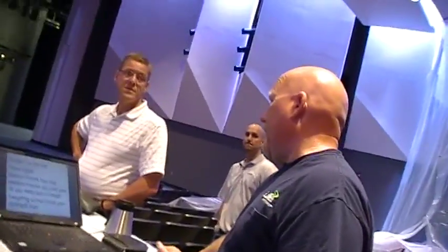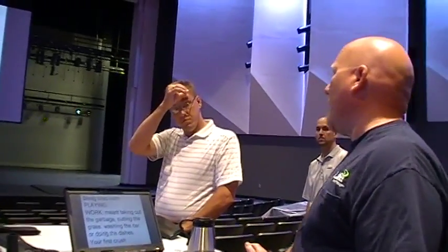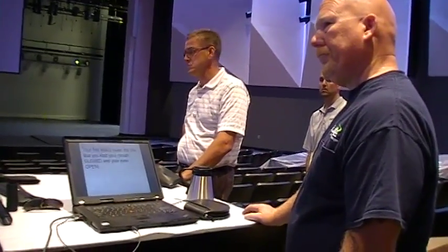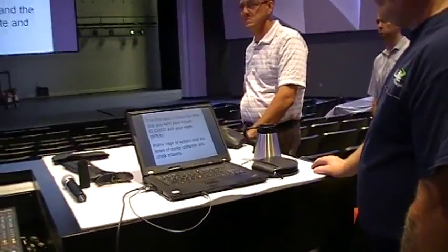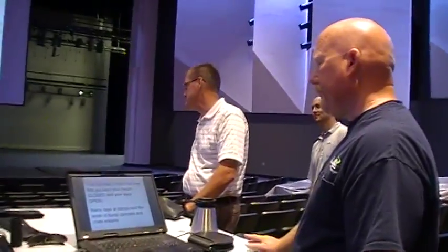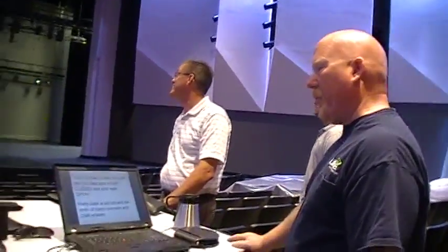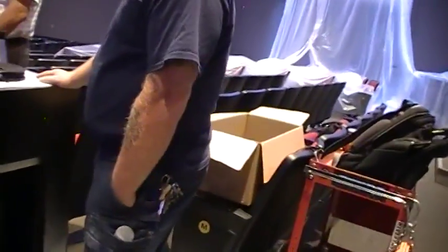Because the signal that we have is a composite video signal. So if you have input left on that TV to accept that input, that's something that you definitely could do. We just got to get a cable from here to where we're going with it. Okay. We'll really need that, because we got three more outputs on the distribution amplifier back there.